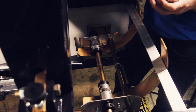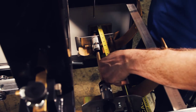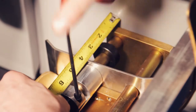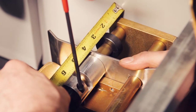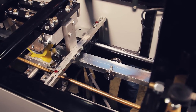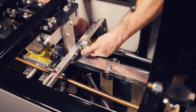First we're going to talk about if we need to increase the length of the lip. Our first step would be to use a tape measure as a reference where my right entry guide is. Then I'll loosen the locking bolt and I'll move the right entry guide away from the center of the machine roughly the amount that I feel necessary to increase the lip. Second, we need to adjust our right auxiliary post entry guide the exact same amount away from the center of the machine that we did the right entry guide.